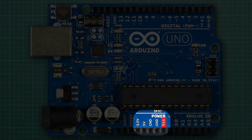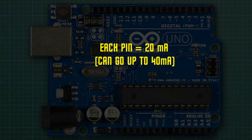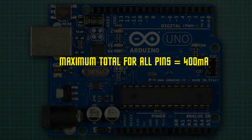The pin on the far right of this group, labelled VIN, allows you to feed your input voltage straight into the circuit. So if you're running the Arduino off of a 12 volt power source, you can plug these 12 volts directly into your circuit. This is great for running motors and lighting an LED strip. Unfortunately, the Arduino outputs very little current, so we can't run a whole starship's lighting from this one VIN pin. Each pin on the Arduino has an output of around 20 milliamps, barely enough to light a single LED. To protect the board, the Arduino's total output does not exceed 400 milliamps. So to run a starship we need relays and MOSFETs, but we'll get to that when the time comes.